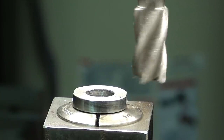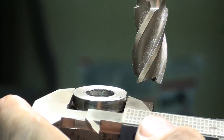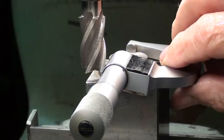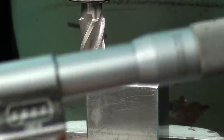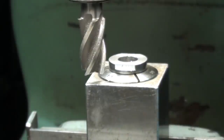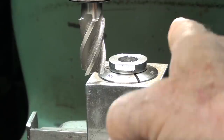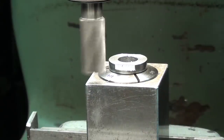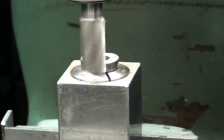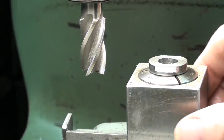I've got to emphasize there will be hundreds of ways of doing this — perhaps you have a better way. Now I can take a measurement and determine how much I have to take off of each side, and I won't show all of that. I am now at 802 thousandths, so I have 22 thousandths to take off. I've already moved it in half of that, which is 11.